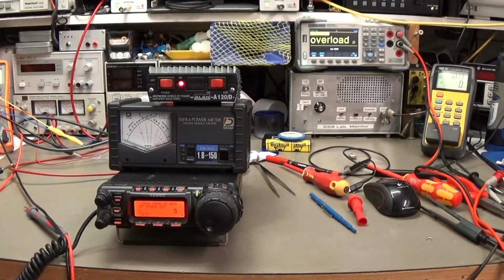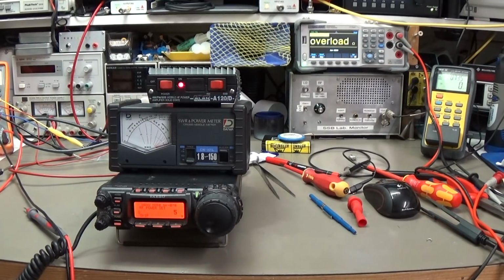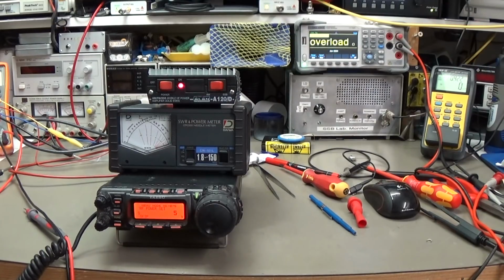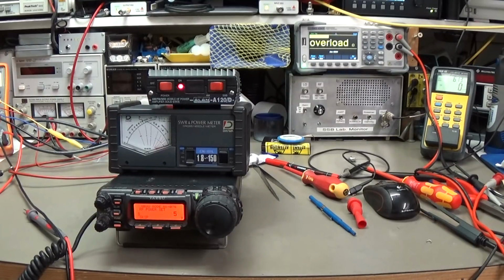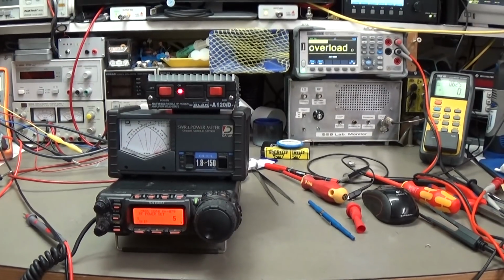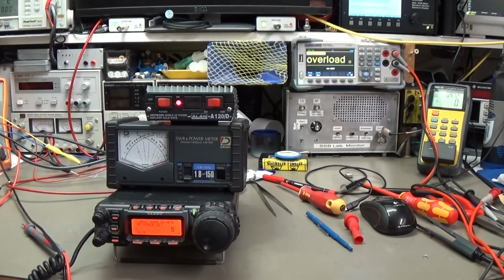Now it can go back in the RPRS setting, and of course the operator has filters which now get placed behind this amplifier, because this little amplifier does not have any output filtering. So that means a lot of harmonics will be available without any low pass filter at the output. And therefore, of course, in the setup there is an external filter. So for anybody who might ask, it is all as it should be.